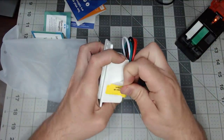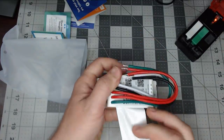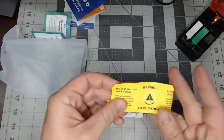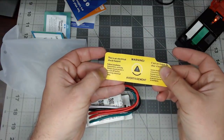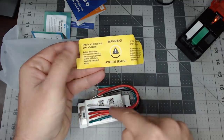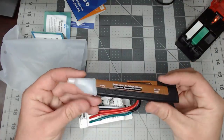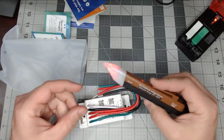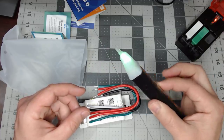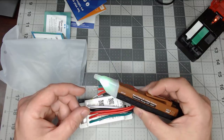On the switch itself, peel the sticker back — there's a warning that you should turn off the electrical box, so don't forget that. Turn your electrical box off when you're installing this. As we've talked in the past, definitely use a circuit tester to look for any live circuits you may not realize are live in the electrical box when you're changing these switches.